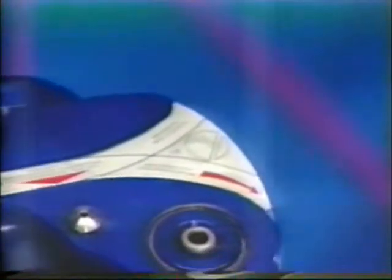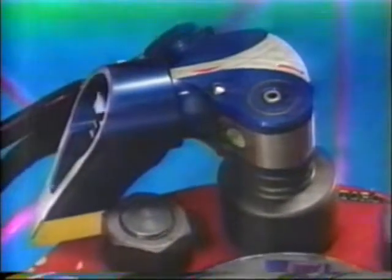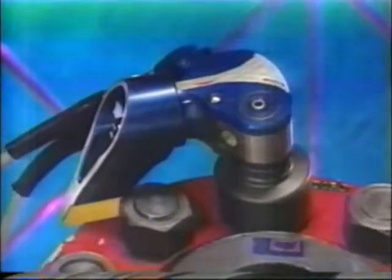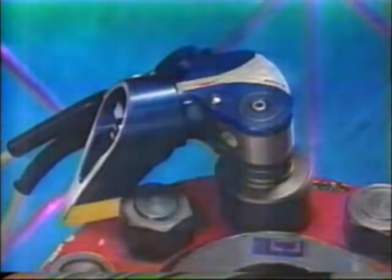The reading of full preset pressure after the cylinder has been fully extended does not mean that this pressure has been applied to the bolt. It only means that the cylinder has been extended and cannot turn the socket any further until reset. Once the remote button is released, the cylinder will retract and the MXT will automatically reset itself.